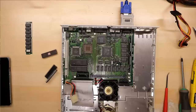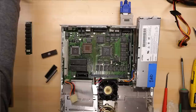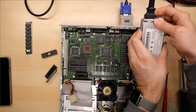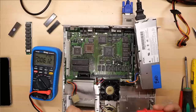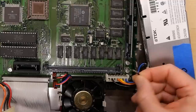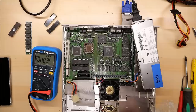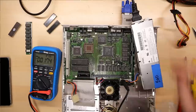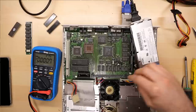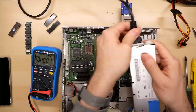One more thing to try — let's try this original power supply again and see if it's coming to life now. I didn't even try it originally; I just took Ed's word for it that it was bad. I'm pretty sure it was just protecting the motherboard because of those chips. I'll grab the multimeter to quickly check the voltage rails. One of the ground leads just broke right out — so that's one of the ground leads gone. The others seem fine. It probably would work with one ground, but not ideal. Let's try it. It's not even starting up — I hear it clicking inside. Yeah, this power supply is definitely not working.